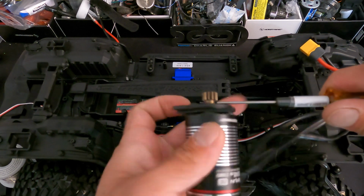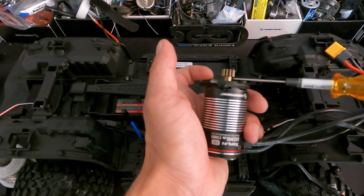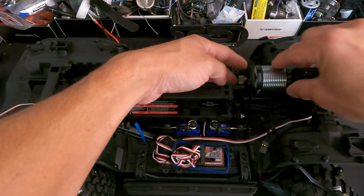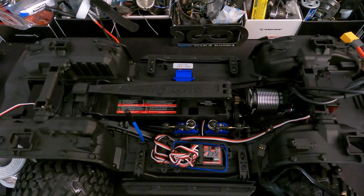There you go, there's your point of reference. If you take your wrench and you go even with the head of the screw through your set screw wrench, and you just make that parallel, touching the screw, that should be perfect. Yeah, look at that. All right, good enough for me.